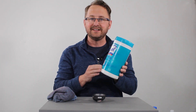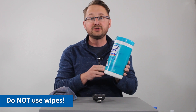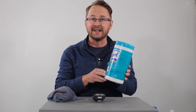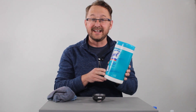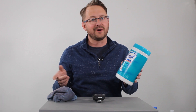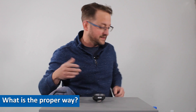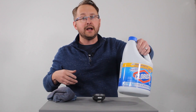Now the wipes — here's the problem: wipes are oftentimes scented, and oftentimes we don't know the exact chemical makeup in them. Both of those can be problematic for the gas detector. A lemon scent sounds great, but it's problematic for the sensors and may result in them not working or just screaming at you the whole time — so I'd advise against that.